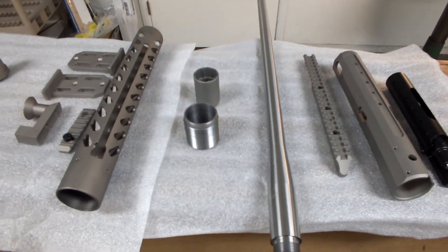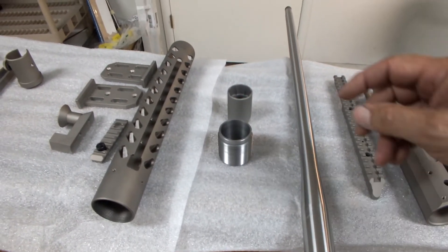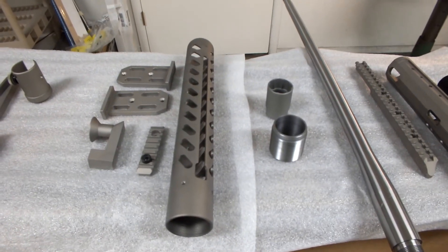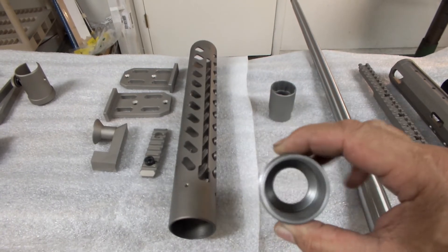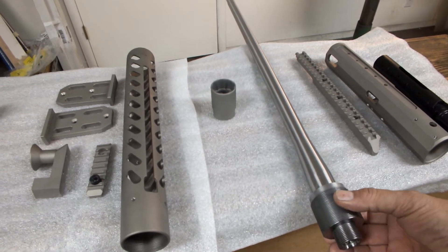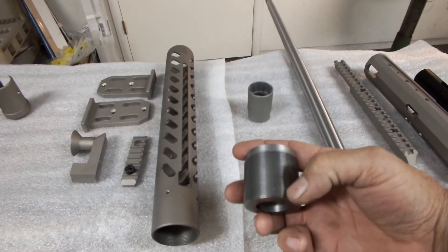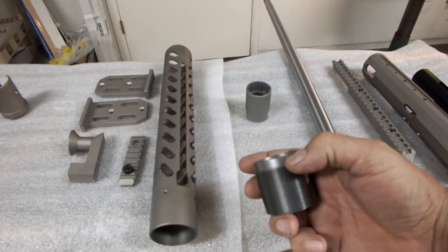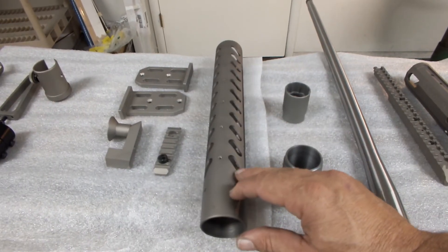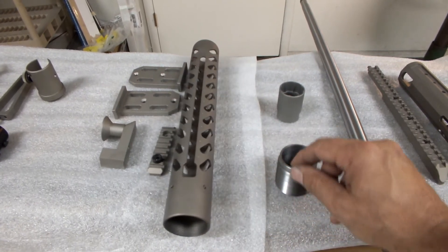We use the Brux Cut Rifle Barrel — it's a very good, high-quality barrel. The forend attachment is different, kind of new. It attaches via this little steel cup that fits onto the barrel, clamped between the sleeve and the barrel, and then the forend threads on here. This section that is not threaded is a little bit smaller in diameter — that's how you lock it in place. The forend has four set screws that correspond to that location on the sleeve and lock it down.